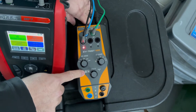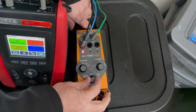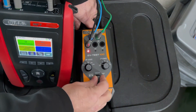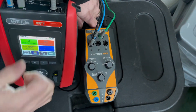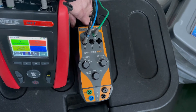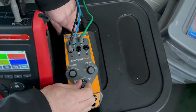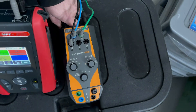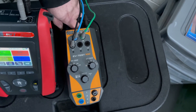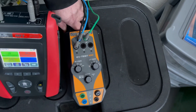Going to the status button at the bottom of the EV Test 100, we perform an earth fault — which is not available on some EV adapters — and we should lose the L1 light and hear the EVSE charging station clunk out. There we go: we've lost the L1 light, the charging station has clunked out, so the earth fault has cut the power and there's no charge going to the car. We can also perform an electrical fault, and as you can see the L1 light has still not returned and the contactor has not engaged on the EVSE charging station.